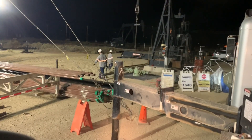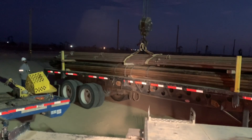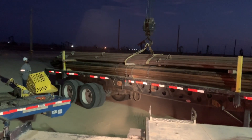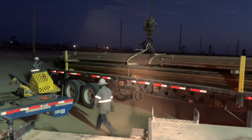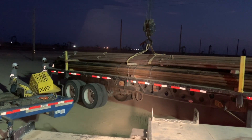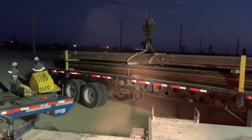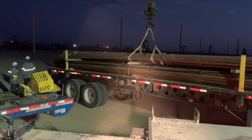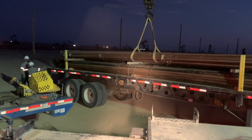Touchdown — there it is. In this clip what you see is I'm putting the hook over the center of the load. Why that's important is if it's not over the center of gravity of your load, it's either going to swing away from you or towards you, and that's just not good.